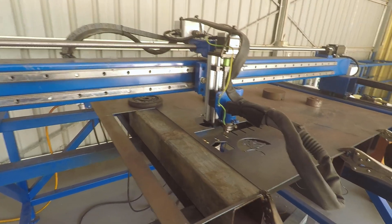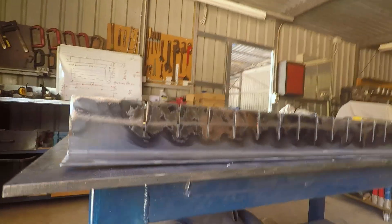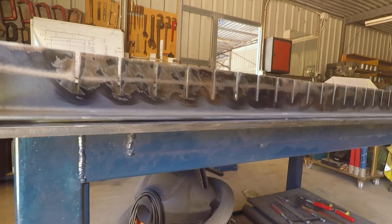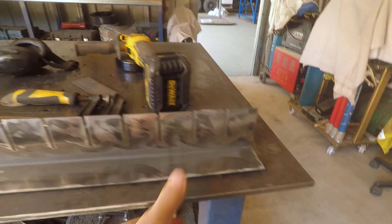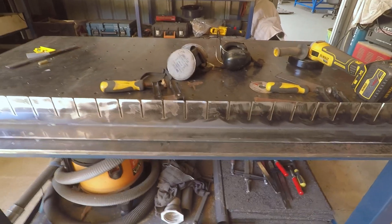The first thing to do is get these slat frames to sit level. I've got the slat frames here on the welding bench and as you can see there's a bit of a gap under there. All I'm going to do is clamp down one side, put a little packer under the middle, then squeeze the other side down and slowly bend this to the right shape to get it nice and flat.